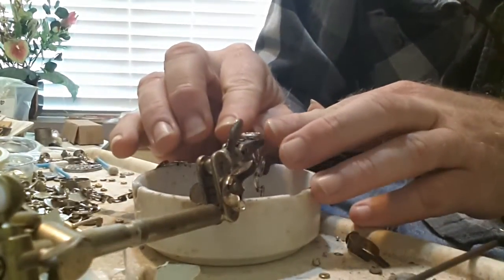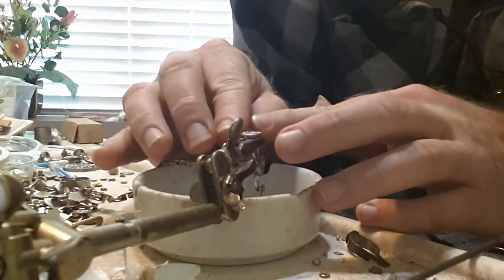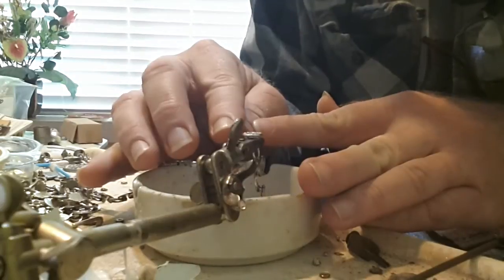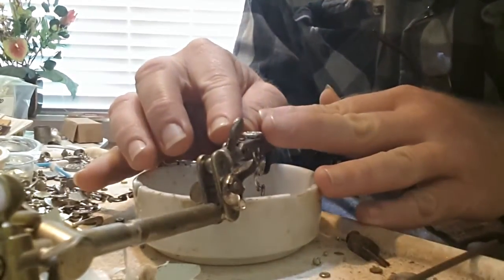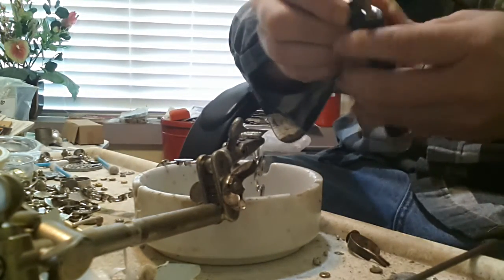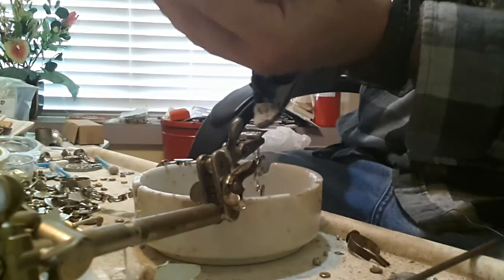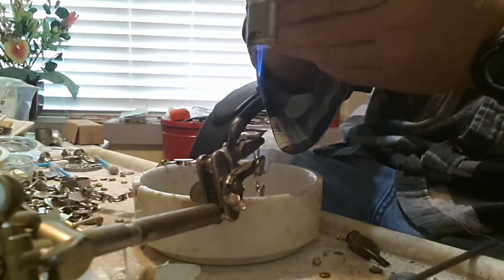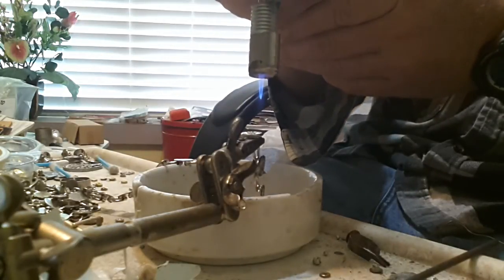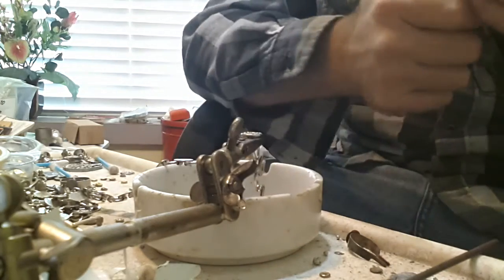Line the font lettering on the head of the shell so it lines up with the rest of the other shells, then try to center this on the pad. Sometimes it's good to use a little metal clip to hold the shell head down to the pad, but sometimes things go right. I'm just going to draw the solder up along the bottom of the shell head — move the flame over slowly, not to heat it all in one place, but to get overall slight and gradual heating through the middle of the shell head. There — drew it up, set it down.